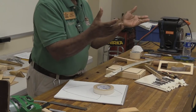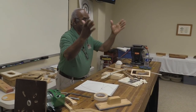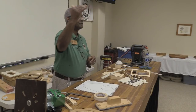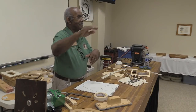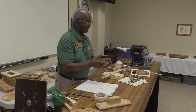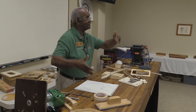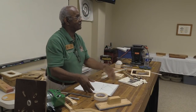I use paint cans, I use anything in my shop that has a curve I need. I did a cutting board once where I used a metal garbage can — I did two things called a peacock cutting board with different little colors. The top radius I marked with the top of the garbage can; the bottom radius I marked with the bottom. I also use little plastic serving trays — even if the bottom is broken, the top half gives me the arc of the amount of curvature I want.